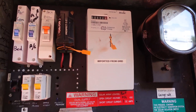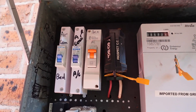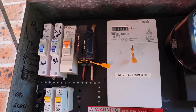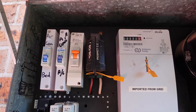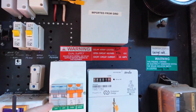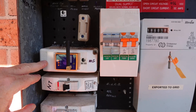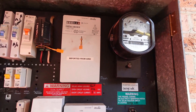Obviously they didn't look inside here. This is the new one they've just installed. But the first time they came out, they obviously didn't see - aircon, aircon - these are the two isolation fuses for the existing aircon systems. And they just went, 'oh, bugger, it's much easier just to wire it into the wire right there next to it, into the existing power point.' And we've only got two existing power point circuits - this does the entire house. Of course, they didn't see that I had a solar analytics monitoring system either. Absolutely nuts.